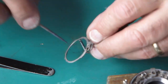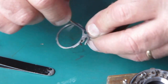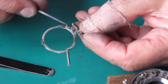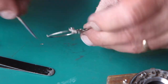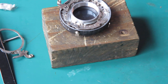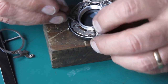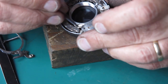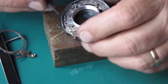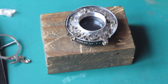So, molybdenum paste once around the inside, once around the outside edge, some at the head of the bird paw, usually with a wipe at the tail there. Taking the shutter, there's a couple of spots here I want to touch. On the retard gear train, on that arm there where it contacts the settings plate, and here, and here, and I think that will do.